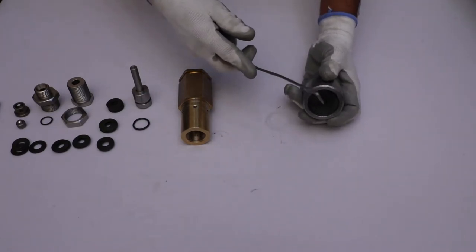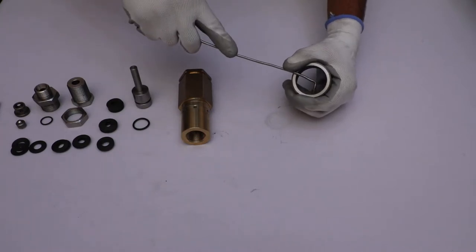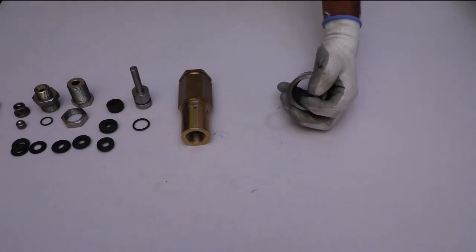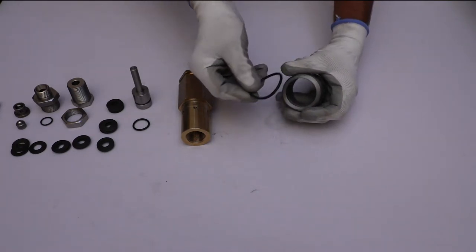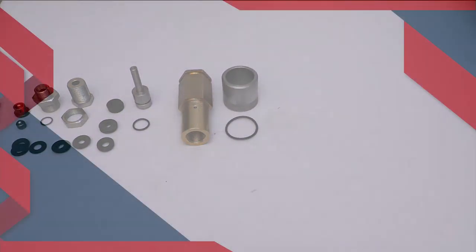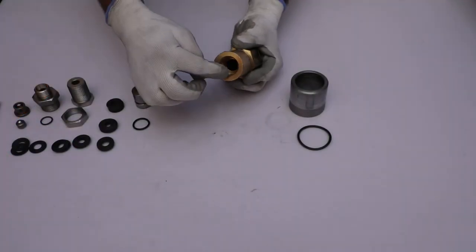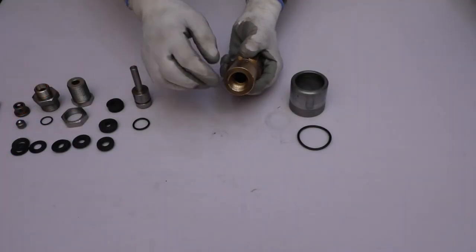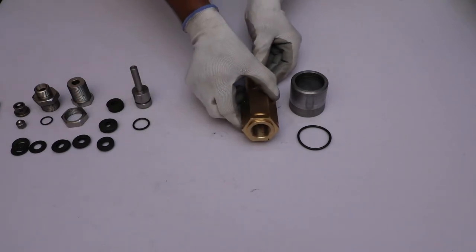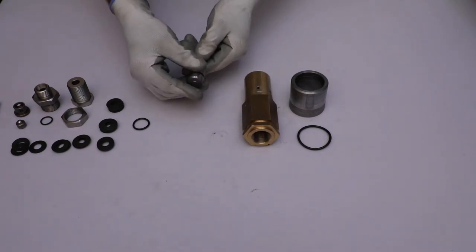Take a pick and remove the o-ring from the zinc-coated cap. For inspection of parts, check the inner diameter and thread of the main body for any type of damage. Also inspect the spindle for damage and pitting.